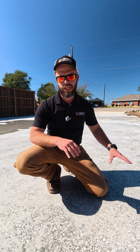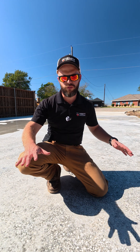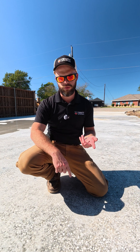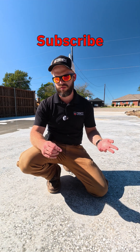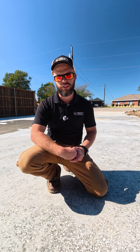So this concrete slab, by default, is going to actually weigh the same amount that it did when it was poured. But because water is necessary to the cure process, we encourage our clients to keep the surface moist as much as possible. Sometimes this is done through tarping, sometimes through wet fabrics. In this case, for example, we're just keeping a sprinkler on it for several days.